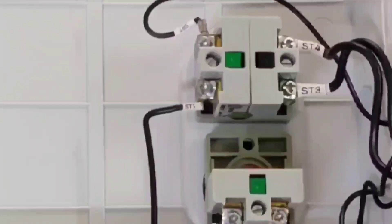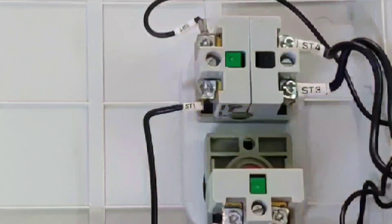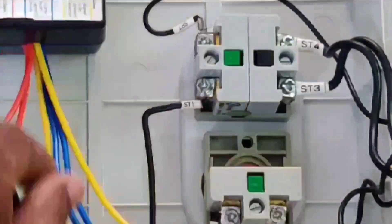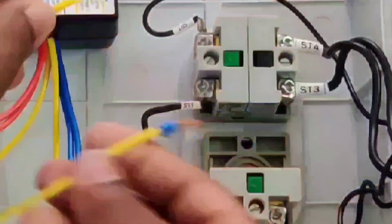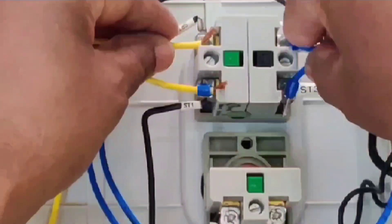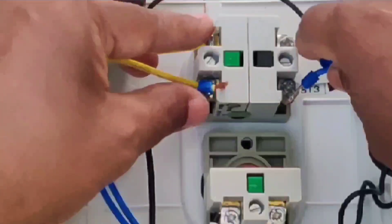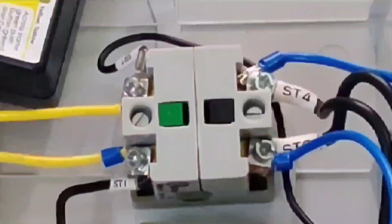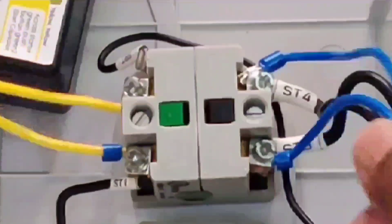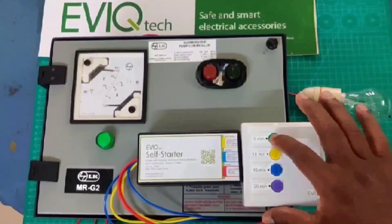This one has an on-off push button. The SwigoSmart connection is the same as discussed before. For the SelfStarter: the two red wires are connected to the SwigoSmart output side at 230V. The two yellow wires are connected to one pole of the NO contact. The two blue wires are connected to the other pole of the NO contact — one going to the starting capacitor circuit and one to the contactor coil circuit. Two yellow wires on one pole, two blue wires on the other pole. Now we can switch the motor on through our SwigoSmart.